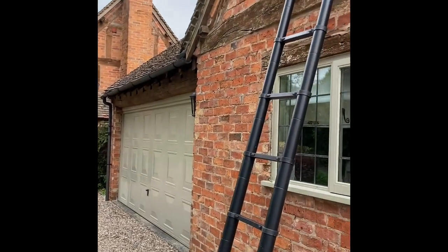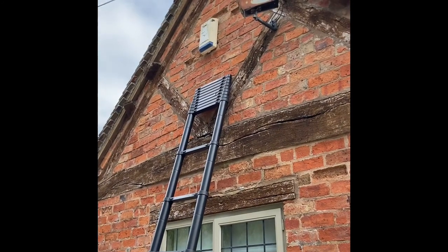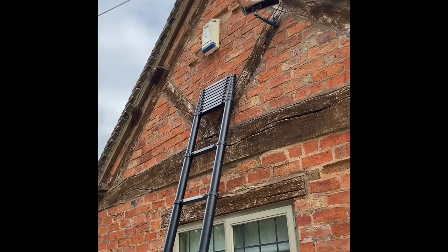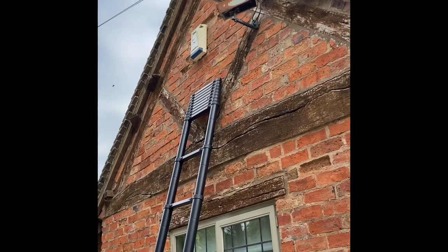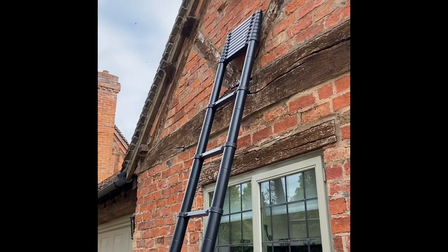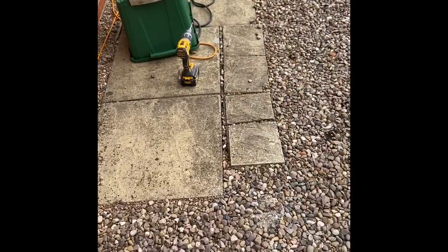In a nutshell, I changed my colours once I moved from my previous alarm company, which was 19 years ago now. The colours that I used to use were red, black, positive, negative. Signal negative is blue. Tamper return, yellow. And a variation between white and green for the strobe light. But now, it's totally changed.